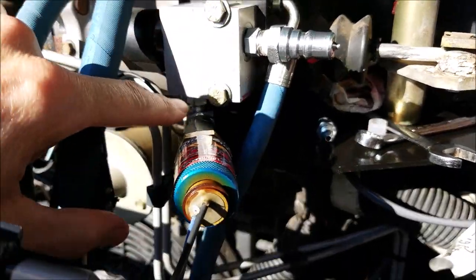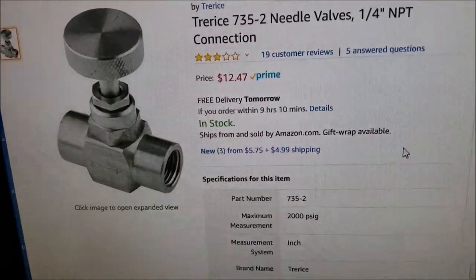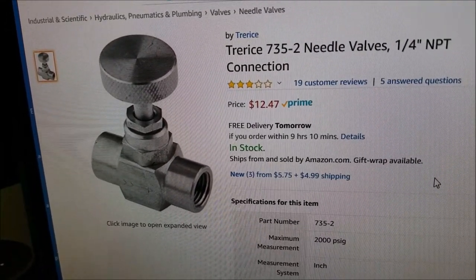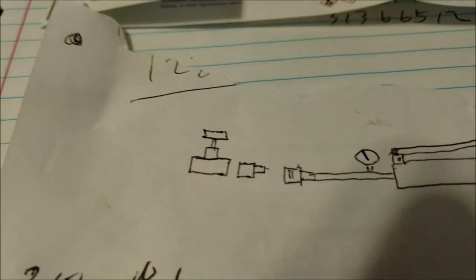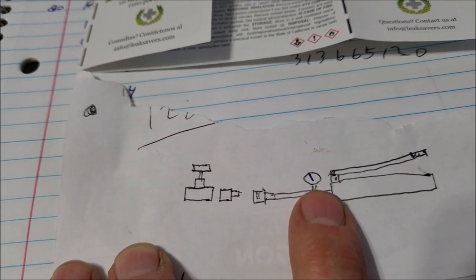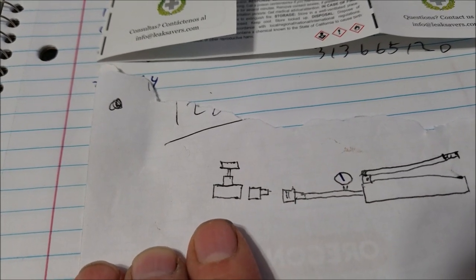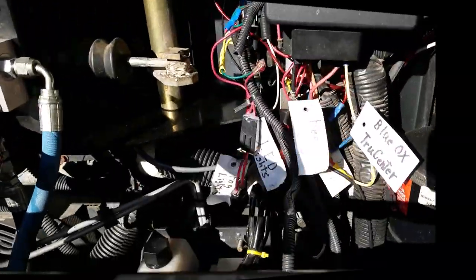For those of you who don't have the Ultra Stop upgrade installed, you'll need to do something a little differently. You need a way to hold back the pressure so you can relieve the porta-power. This inline valve will hold back 2,000 psi. Here's a quick schematic: porta-power with your gauge so you can see psi, a little quick connect, and that valve. Pump it up to about 1,500 psi, crank down the valve, bleed off the pressure, disconnect it, and your auto brake will be released.